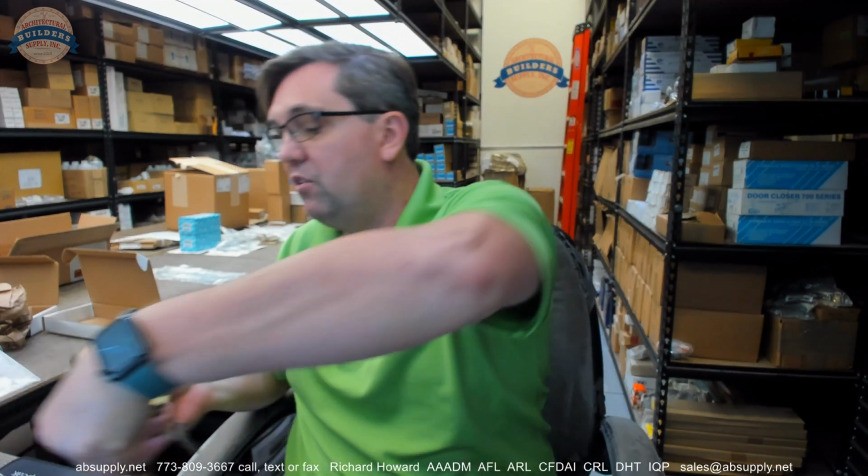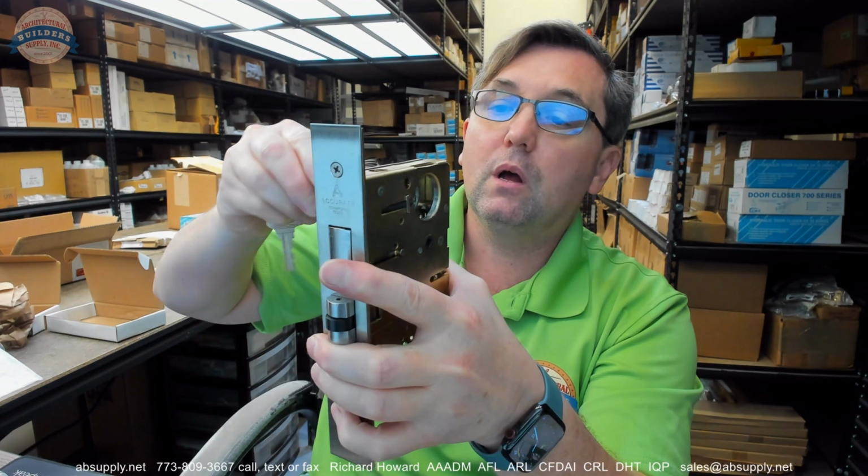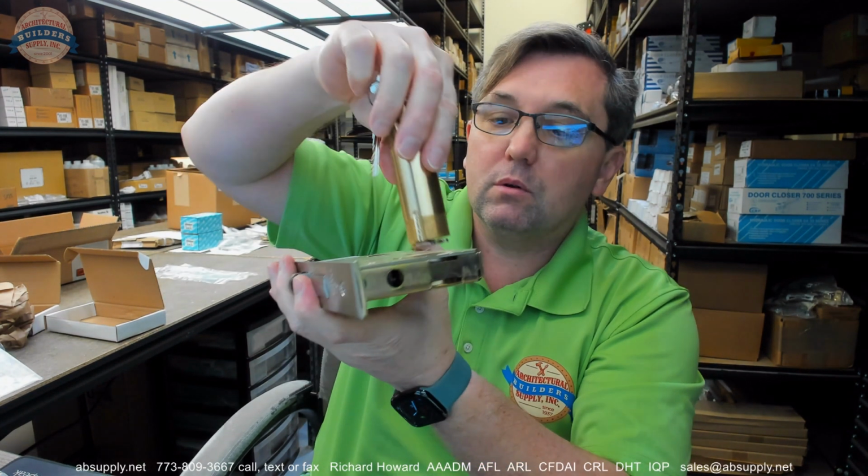I do that, I wouldn't say all the time, but I made 2 cylinders last weekend, and we can do that. So the point of the matter is, we've got a 7-inch thick door. I need a cylinder that's 3.5. No problem. We're either going to use a single piece like this or we're going to stack some other ones. It's easy stuff. Since we're playing with this cylinder, that's what's called a cloverleaf cam. Cloverleaf is the term. Every manufacturer will have a cloverleaf cam, I believe, and that's what Accurate needs for their mortise cases.